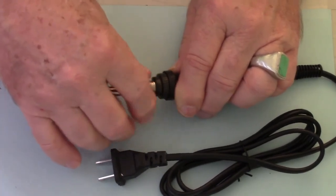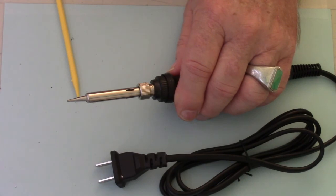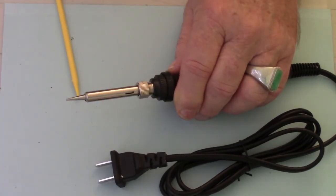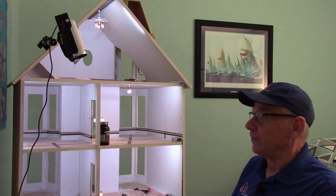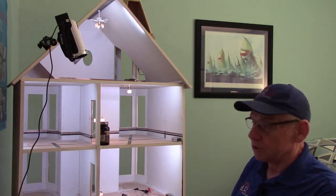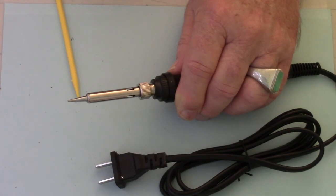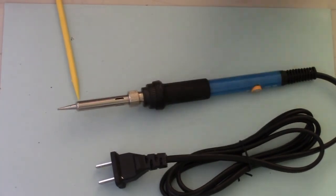While I'm at this collar, I'll mention that after you have used the iron, when you clean it and are ready to put it away, unplug it, let it cool, and then loosen the nut. When you start again, make sure that nut is good and tight. If you don't do that, the heating and cooling of the mechanism in here will freeze that nut onto the threads, and it can become very difficult to unscrew at a later date. If you get in the habit of loosening it every time you're done soldering, it really helps in the maintenance and use of the iron.